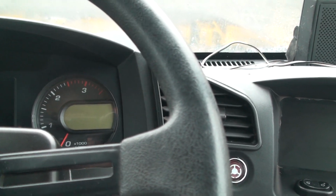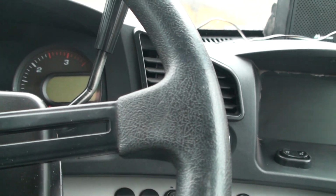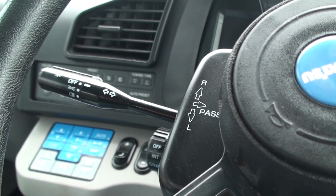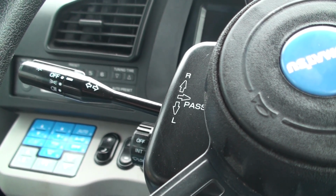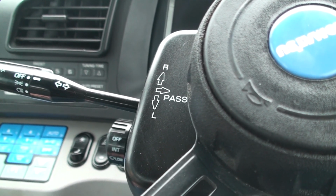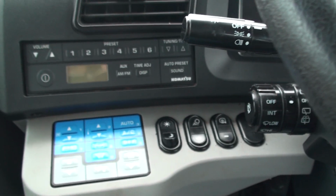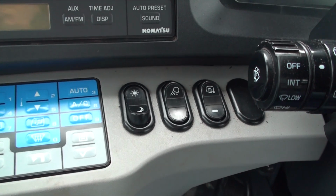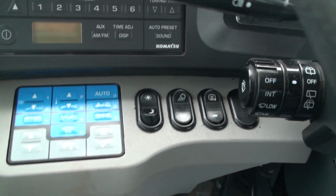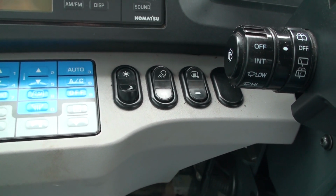The lever on the right side of the steering column is for the retarder. The horn button is in the center of the steering wheel. The turn signal stem also controls the head and tail lights. The barrel switch below the turn signal stem is the windshield wiper control. Forward of that barrel switch on the dash are more rocker switches. To their left is the multifunction pad.